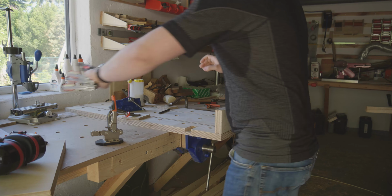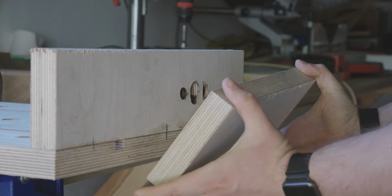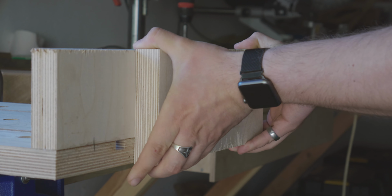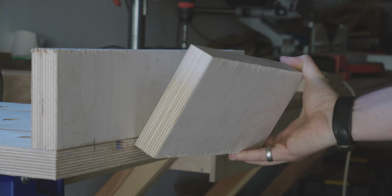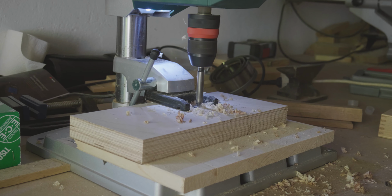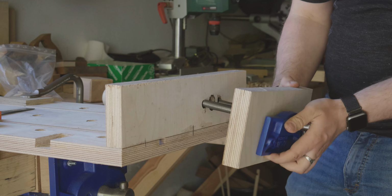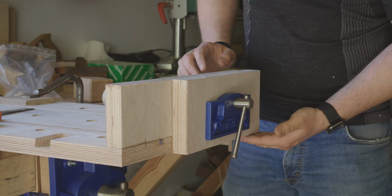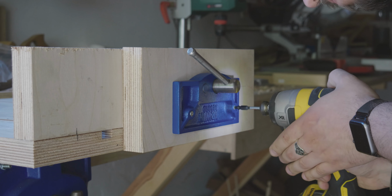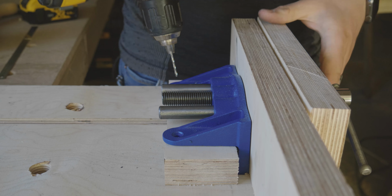The vise should get a multiplex piece as a clamping jaw. The jaw is pierced by the guide rods and the threaded rod, so it also needs 3 holes. The procedure is exactly the same again. Measure out the holes, mark them, drill them, find that they do not fit right, adjust the holes until they fit, put it in place and screw them tight. Due to the clamping jaw, the vise also gets a larger contact surface.